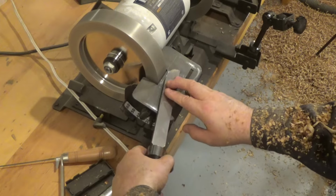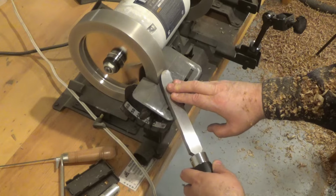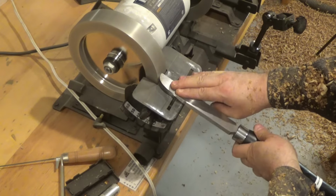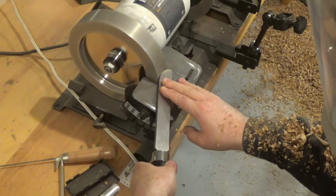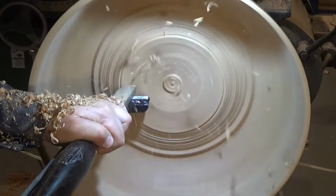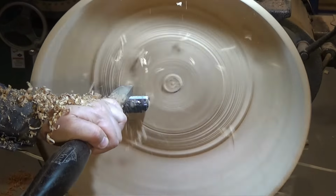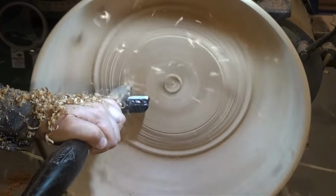When I'm turning a bowl, I like to set the grinder with a wheel for the gouge and another wheel for a scraper. The wheel will leave a burr in this heavy scraper that, more than scrape, it will cut the wood. Since the sharpening is so quick, I can return to the wood turning really fast. You can see the nice shavings obtained by a scraper just sharpened.